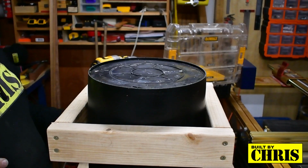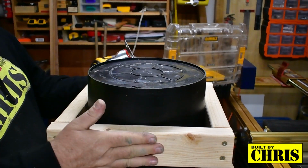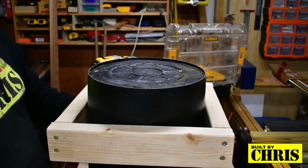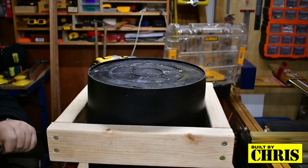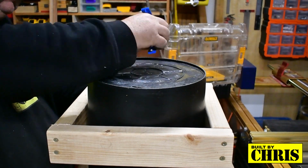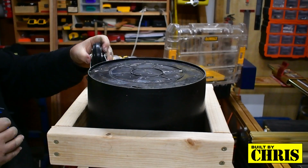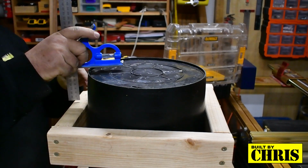Okay, I got the bucket tipped upside down. These wheels with the first base around it, they've got a ride height or a finished height of 95mm. So if I drop this bucket down, or this frame down, so that it's 80mm around, in theory, that will leave me with 15mm play, which is exactly what I want, because I want this bucket to sit low.